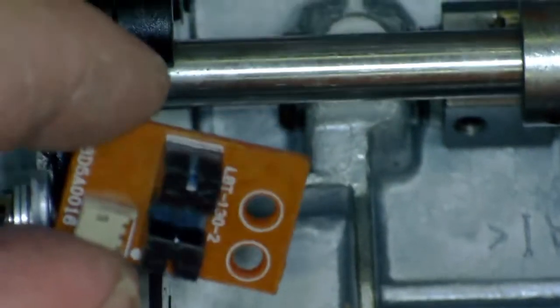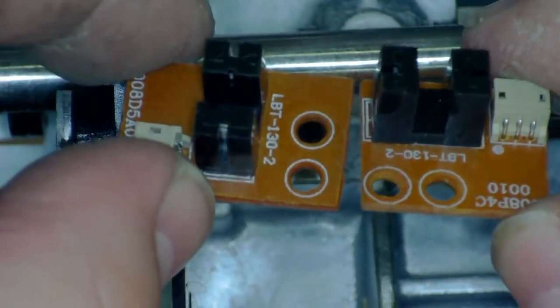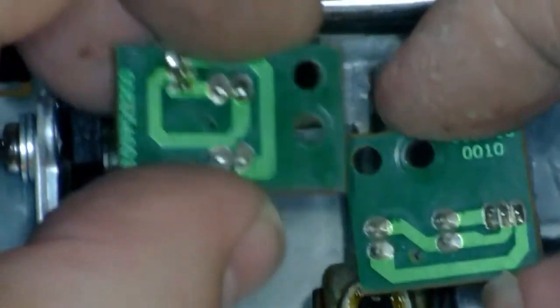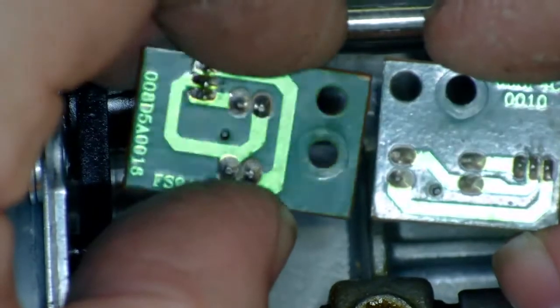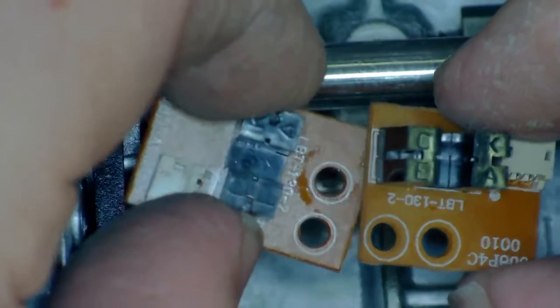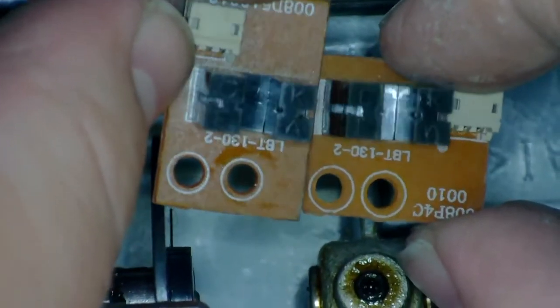It's pretty close. They moved the mounting holes a little bit, but same basic design. Silk screen one side. No use of solder mask. They got rid of that entirely. Using the copper to lay out the board identification markers. Real nice heavy traces. I've got nothing bad to say about this, except that maybe he could have worked with a mechanical engineer and made this all just one single board. I mean, they're really close.